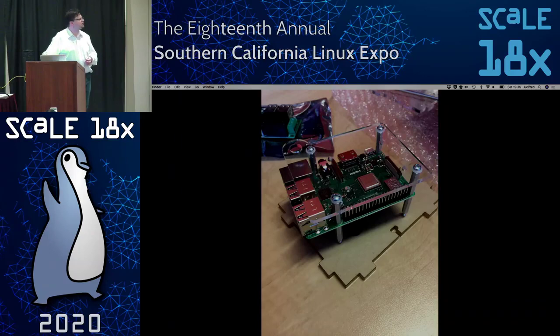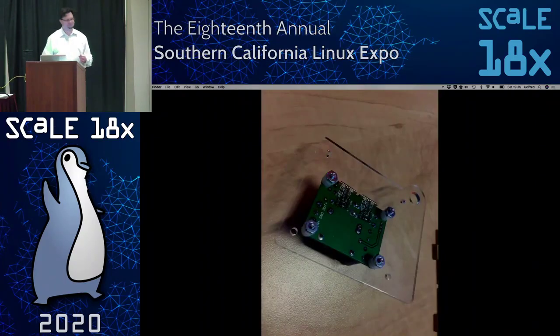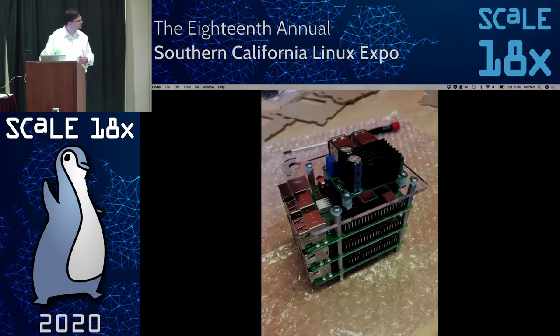The kit with the pre-cut plexiglass was made by a company called Pico Cluster out of Utah. I think they are in Orem, but they're somewhere in Utah. These kits come with power distribution units that are already pre-built, so I didn't need to design any of this. The one for the Pi 3 is simpler. It's a standard USB switch, and it can also carry data. The other one is a more complicated custom board to distribute USB-C power. And since there are higher voltages there, you can actually get blue smoke out of the big cluster if you don't pay attention.